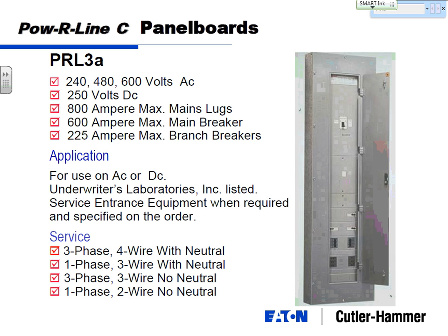So Todd, what's the difference that they do? Other than bonding the neutral to the ground and the neutral to the frame, what else do they test other than look different than any other panels? Do they have rigid tests that they go through? It just means bonding the neutral to the ground and to the frame of the box by code. Yeah, basically it's a removable neutral ground link. And I think in the case of this panel, I'm not sure we even install it. I think we just put in a baggie a small piece of cable with the grid so you can connect the ground and the neutral together, and the sticker that you put on yourself. And the ground is tied to the frame anyway.